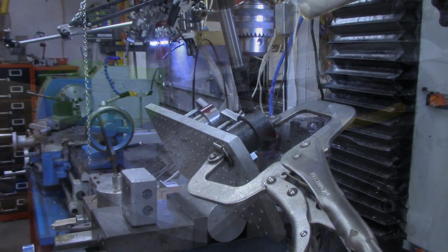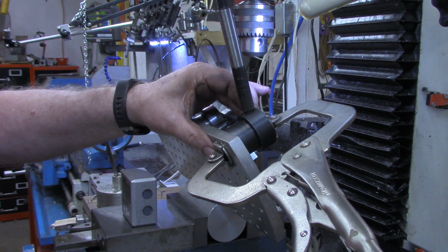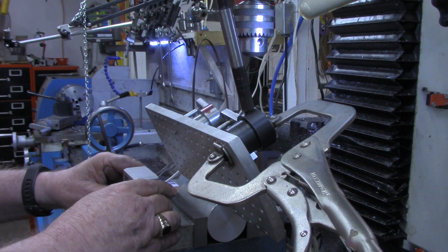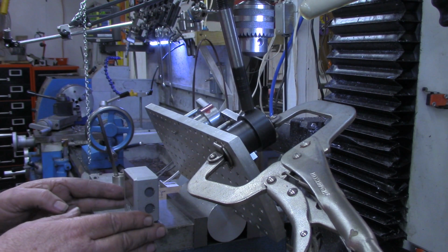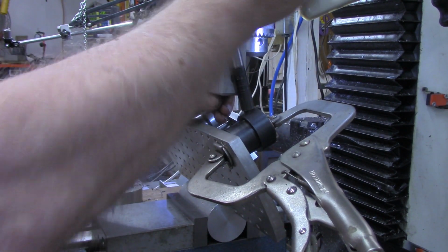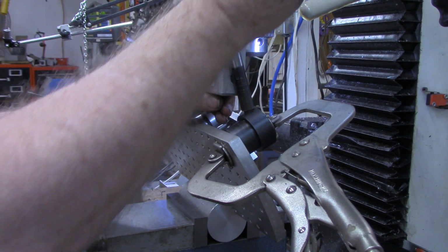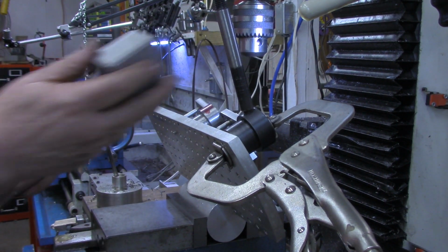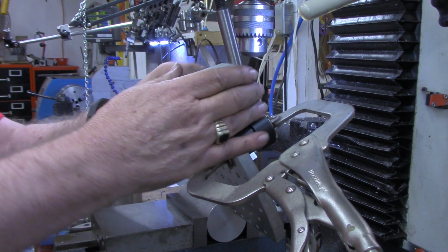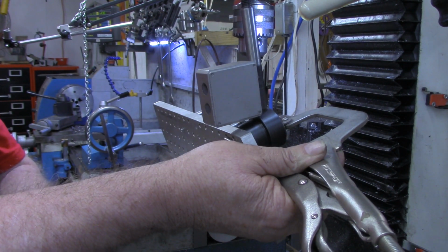Okay, I've got the original handle and the mount for it clamped onto my plate now. I'm going to use my angle cube, and first thing I want to do is zero that on the mill vise. Get it plumb in this direction. All right. Now all we want to do is set the angle plate. See if the magnets will hold that. We're going to raise this up until it reads 0.